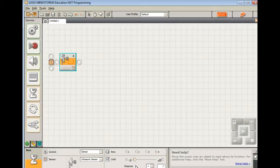Does that make sense? So one of the things we're going to do is drive one of our plastic balls, and we're going to use the light sensor. Well, how do I know? I want the robot to approach the ball until it gets really close. Well, how am I going to set that? I'm going to take my robot over there, put my tee down, and put it how close I want it to be to that ball. And I'm going to view the output of the light sensor. And if it says 15, then I'm going to set this sensitivity to what? 15. And then when that thing comes up and sees 15, we're going to stop it and then do what? And then swing the golf club.